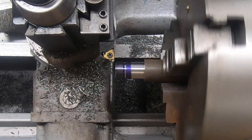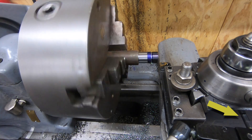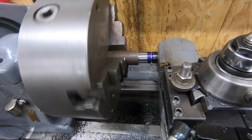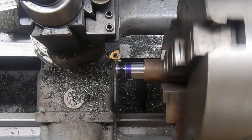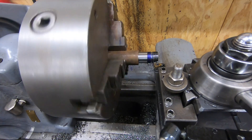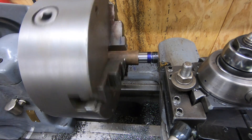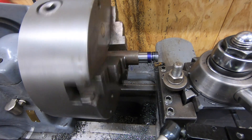You can't see it from either of the camera angles I have pointing at the lathe, but I have a dial indicator set up on the back of the tool post on the compound, and I have the compound angled at about 29.5 degrees. My goal is to feed the tool in about 27.7 thousandths of an inch deep, which should give me a full profile thread. For these first few passes I'm advancing about three to four thousandths, which gives me about a six to eight thousandths decrease in the pitch diameter.